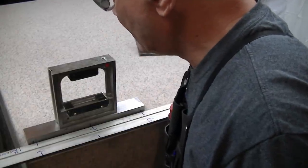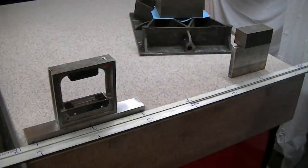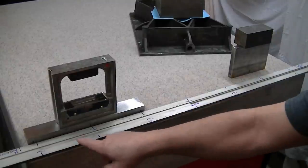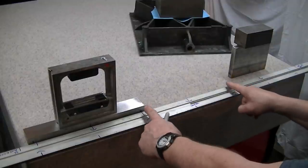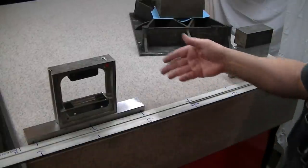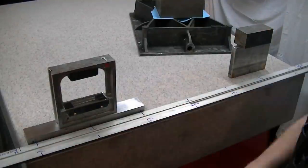And that's probably barely a tenth from here to there, rise. Now, in theory, if that's a tenth in that distance and this is a uniform curve, there's some here we're not seeing because we're bridging the curve. If it's a curve, there's still the belly here. If you picture this being concave, which it was more severely before we got to this point. So, in general, we're only talking about barely a tenth rise on that foot.